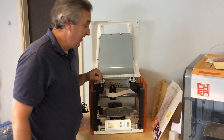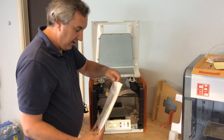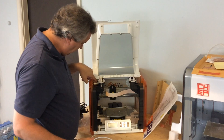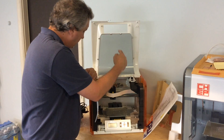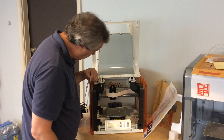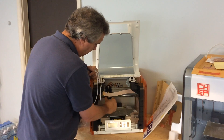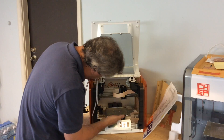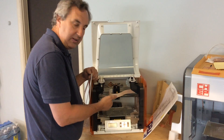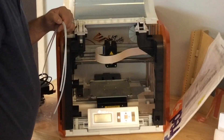So no owner's manual — I'm winging it. Another thing that tells me this is probably an early release: they sent me a separate package containing what they call the loading tube, like a Bowden tube. It's piping that goes from where the filament sits, up through and down into the head. What's different from the DaVinci 1.0 is the bed moves in the y-direction, the extruder moves in the x-direction, and the whole mechanism goes up and down in the z-direction — the opposite of the 1.0.